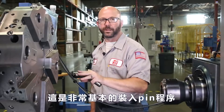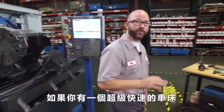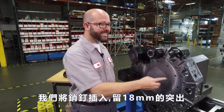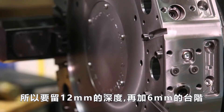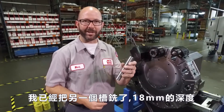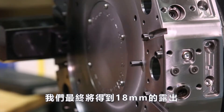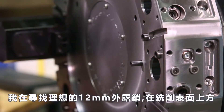This was a pretty typical pin install. Now let me show you our VB-24 turret. If you have a super-speed lathe, there's a six-millimeter step on the surface where we press our pins in. So we're gonna wanna press our pins in leaving 18 millimeters exposed — that's the 12 millimeters we need from the mounting surface, plus another six millimeters to account for this step. I've gone ahead and milled another pocket 18 millimeters deep, which will give us 18 millimeters of exposed pin above the surface, for that ideal 12 millimeters of exposed pin above our mating surface.